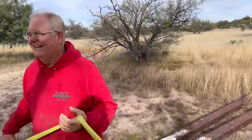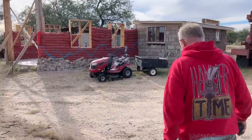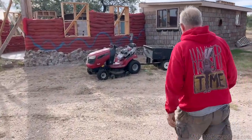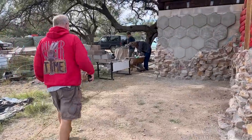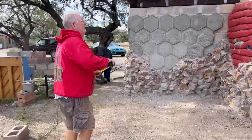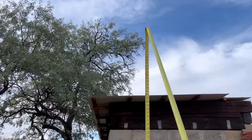Are they tall enough? Oh yeah. Our next step is figuring out where these posts go, and we also have to figure out how they're going to be attached to the building itself — we want more support than just a singular up-and-down support; we want it connected to the building as well. So we're adding a couple of extra cleats here and there so we can tie directly into the wall easily.